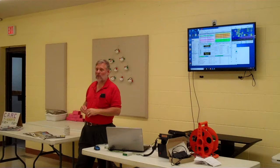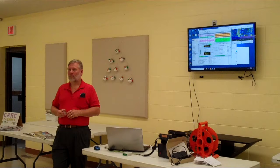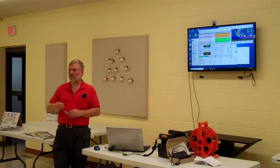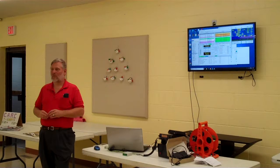With a 50 hertz, 56 hertz bandwidth, there's going to be some overlap, so I have found instances where they have overlap. I've also looked for occasions where not only did they overlap, but one of them was much stronger than the other, and they both decoded. Yes. It is by design that it can find those, because it would be very unusual to have two stations shifting the frequency for the code and information they're sending be identical to another one.